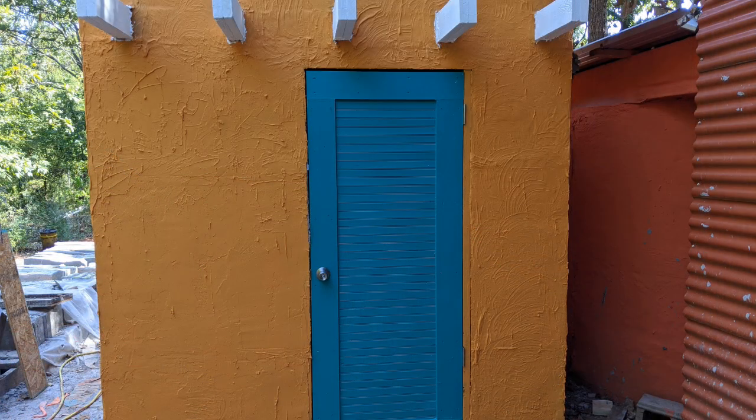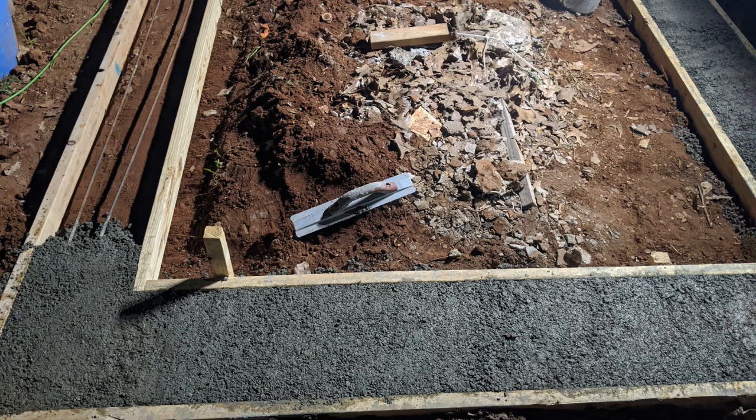For the next structure, I wanted to do a pueblo-style house and try a different building method using slip forms. Again we started with the foundation — leveling the ground, putting down two-by-fours, laying in two rings of steel rebar, hand-mixing sackcrete, and filling the form. We screeded it off level and made the footing a foot wide to better distribute the weight on the earth. This ring footing has its inside filled with either aircrete or plastic foam insulation board and laminate flooring for a soft, flexible floor.